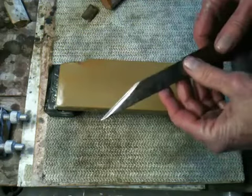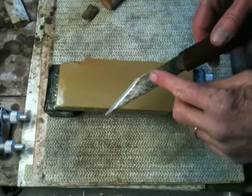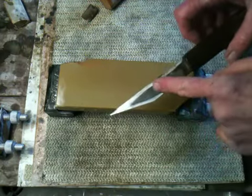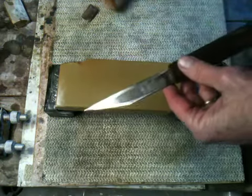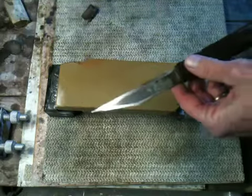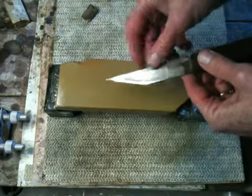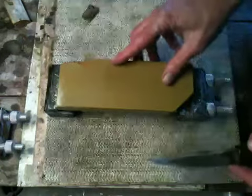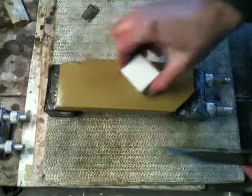This is a traditional Japanese carving knife with wrought iron on the jigane side, and on the back is hard carbon steel. This is similar to what you might be using, although I understand yours is a larger, heavier knife. But this is hard, probably Hitachi steel. So on the kiita, I do have a piece of nagura that we can try testing to begin with.